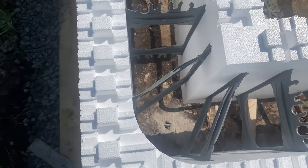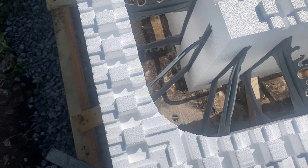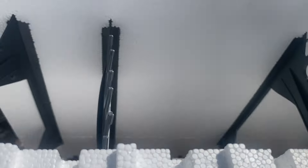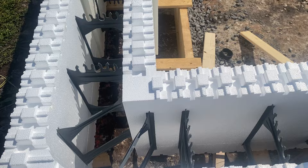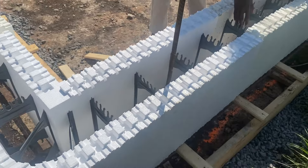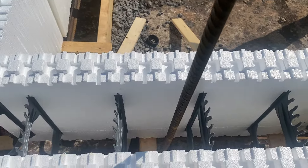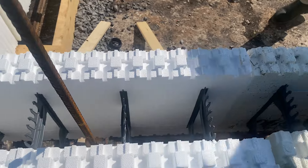The plan — I have improved a lot. When I was doing my ICF I didn't really plan; I just roughly put the dowels and some places it was giving me a hard time — I had to cut these plastic ties. But because I read the plan this time, the dowel lined up perfect on this corner. You can see it's just our first dowel placed vertically. There's another one right there — it lined up perfect right in the center of the ICF. Every 16 inches we have these dowels, and the gap is 8 inches — a plastic tie every 8 inches.